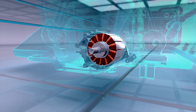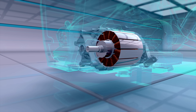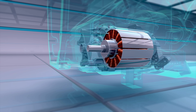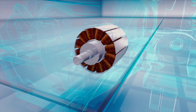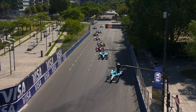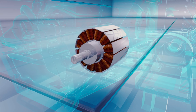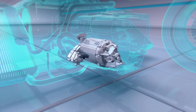Finally, that power ends up at our motor, which has its own limitations for creating more and more power. The resistance in the wires used limits power, and this resistance also generates a lot of heat. To spin the motor with more current, you need to be able to cool the added heat. There are other physical limitations as well — for example, the closer the magnets of the rotor are to the stator, the better efficiency and torque you'll have. However, as the rotor is spinning at 20,000 RPM as you'll see in Formula E, the g-forces can cause the rotor to expand slightly, which if it weren't accounted for could lead to contact with the stator. So you have to balance the efficiency of the gap you leave versus the RPM you want to spin the motor to.